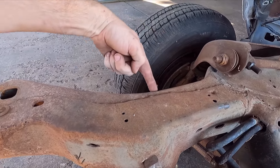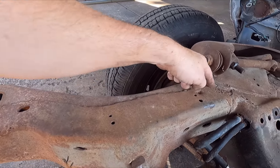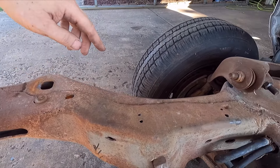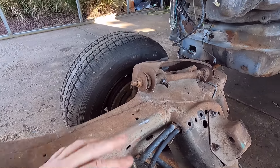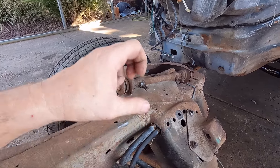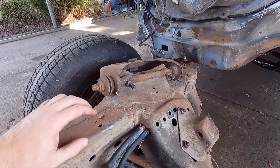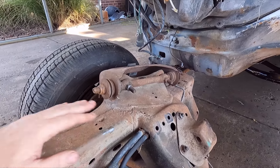What I've done before is take 1/8-inch thick steel, cut pieces that fit directly in that low side right up to the edge - cut it to fit where it fits perfectly so it levels it out - fully weld all that, weld the edge, then go back and grind everything. That makes it level instead of trying to fill that with filler like I've seen people do. A lot of these holes are going to get welded up that aren't being used, because I'm going to change a lot of the brake line and fuel line clamps to the two-piece billet specialty style - they look more street machine, they're trick looking over the factory stuff.